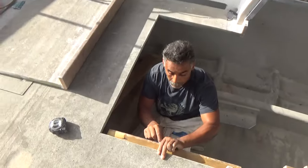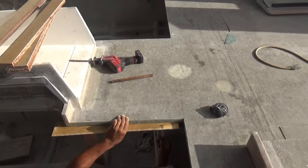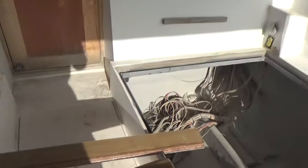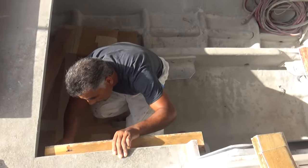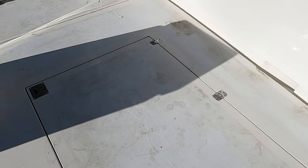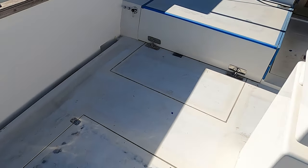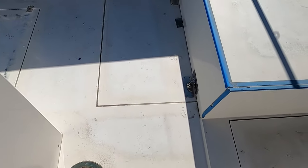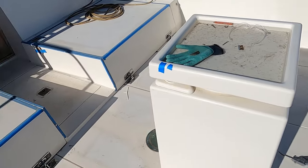We're doing some soft patches in the deck here to make room to get the engines in and out. We're adding some plywood with a lip that's already been glassed and fiber-coated with fiberglass — these go underneath to make a lip, bedded in Q-cell and screwed on. Here's how the deck turned out after being installed and gel-coated: all the hatches cut, hinges set, the bait tank on there. The soft patches are caulked into place but can come up if you need to take out the engine. Ready for non-skid finish and final buffing.